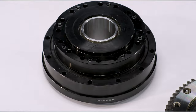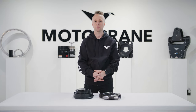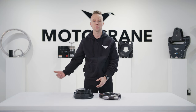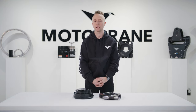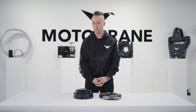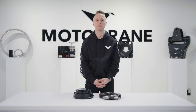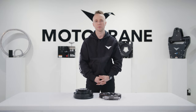It uses a very cool principle of gear reduction which allows it to be zero backlash. And synchromonic is really a two-part word — it is a synchro chain plus harmonic drive solution, first using a primary gear reduction stage of a synchro chain belt which is also zero backlash, giving us an enormous torque output that allows for very high responsiveness and zero backlash on the XP base.